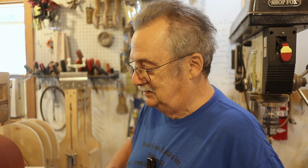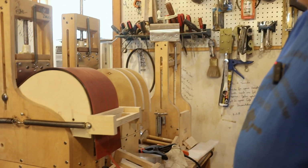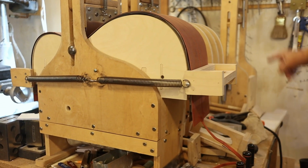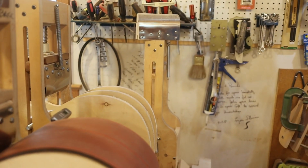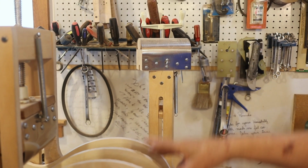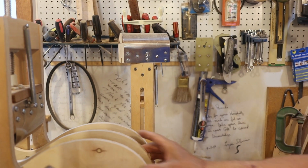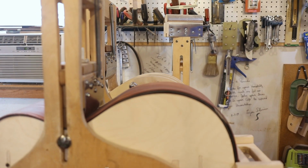Excellent. This bending machine is over 20 years old. Is it really? Yeah, that's an old one. That's my new design, where I can bend anything from a soprano ukulele to a 12-fret dread. I'm changing the design of the bend patterns from the tubes to a 3-rib structure. So I got the CNC machine that keeps me going.